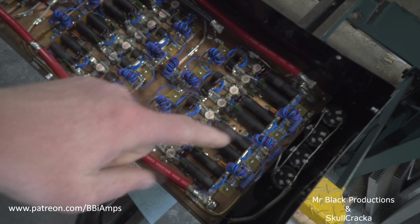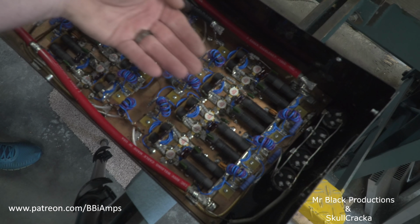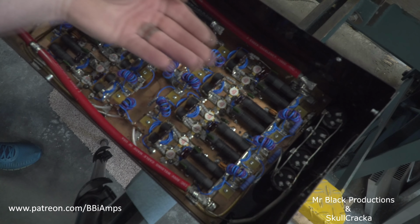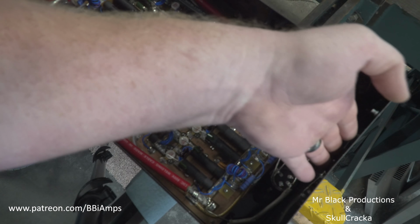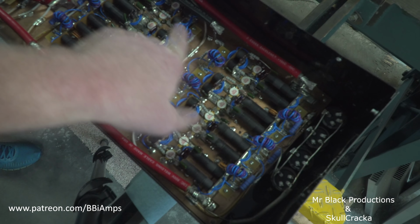Okay. There's a couple things I got to change up here. Let's talk about how the airflow works in here so everybody understands exactly what they're doing with having this capacitor bank up here. Yeah, you're choking off airflow. So the air comes in from the cabinet this direction, blown down, goes this direction, hits this wall, makes a 90-degree turn, and makes another 90-degree turn. It runs right out the back. And then it's got to run all the way out the back.